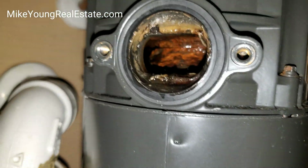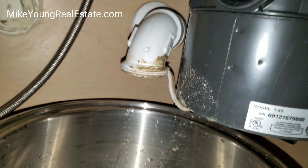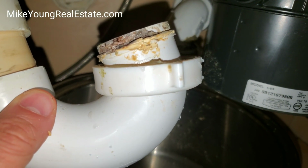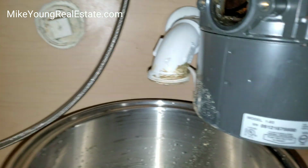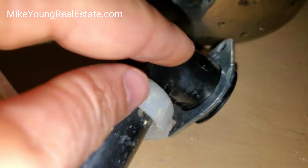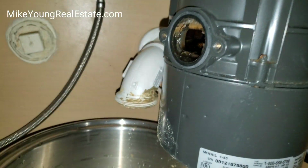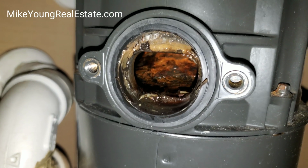So if you have a problem here where it's not draining, or it starts to drain and it still leaks, pull this apart, pull the P-trap off, like I mentioned. Simple enough. Just unscrew these, lefty-loosey, righty-tighty, and you may need a pair of pliers like I did on this top one. This one right here needed a plier on it. And pull this off. This is attached by 2 bolts. And then look inside, and you may find your problem.